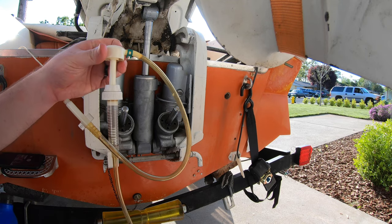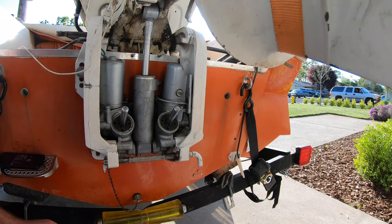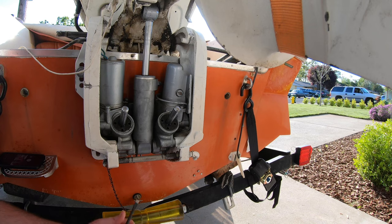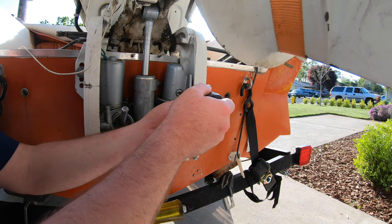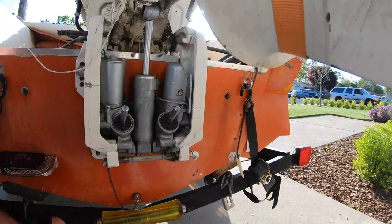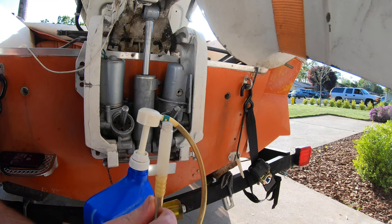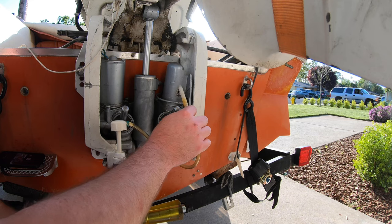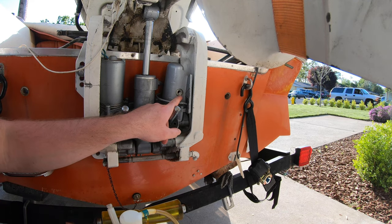Now it's time to fill. I've got my little manual pump here — I'll leave a link in the description — and my trim tilt power fluid. I got a couple of bottles of this. Make sure we close the manual release valve if you've opened that. Take as big a screwdriver as possible. We're going to break this fill screw loose — be careful not to strip yours. Then take your bottle and the manual pump. This little pump has threads for the lower gear unit, so I don't want to screw it in because I don't want to pressurize the system — I just want to hold it in there. You know it's full the first time when fluid starts to spill at the bottom — that's your level indicator.